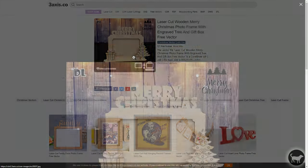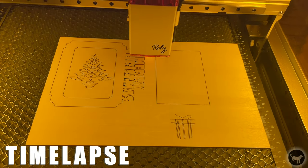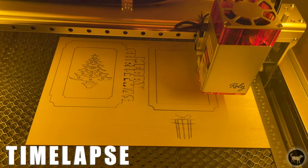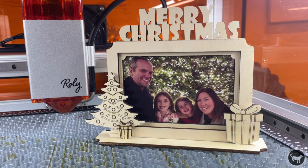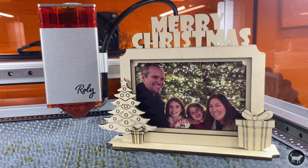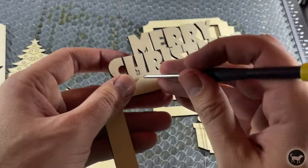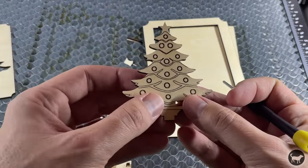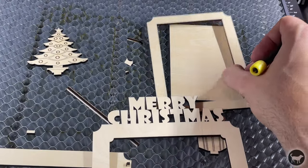Next, I wanted to do some cutting with the machine, so I found this picture frame file online that I will link to in the description. I switched the laser over to the 20-watt and cut everything out at 450 millimeters per minute at 100% power with the air assist on. It did an amazing job of cutting this design out. I ended up updating the design for a little extra layering and was really happy with how it came out. With the air assist on, the wood cut out extremely clean with zero charring on the front or the back. I'm also going to post a link to the 3mm thick bass wood that I used for this and a few other items since it really seemed to work well with this machine.